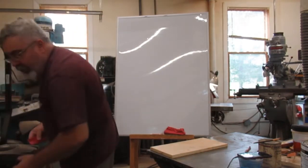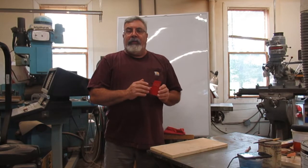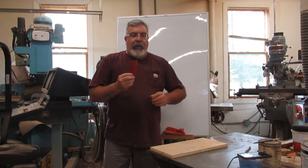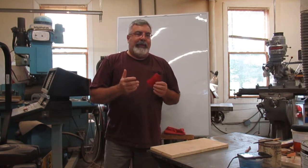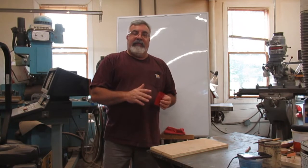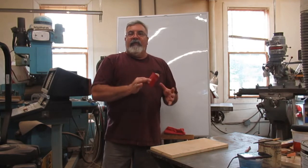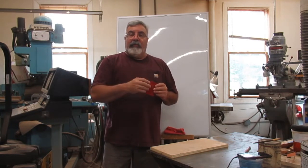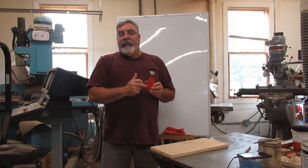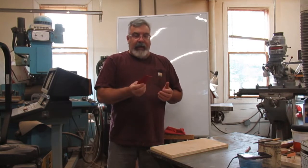So anyhow, like I always say, we want to try to put as many on a match plate as we can. That way we can do less molds down the road, okay? So this one we probably could put like 8 on a board that size, but I don't have the flasks either. So what I'm going to do is I'm just going to put 4 of these on. We've got to do 44 for the club, but like I said, I want to start making these too. A bunch of club guys are interested in having one of these things too. So I'm going to put 4 on a mold. So for the club, we'll need to make 11 molds and pour them in that. But that's what we'll do with this.